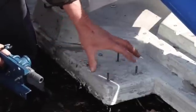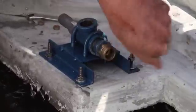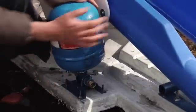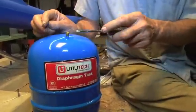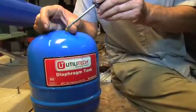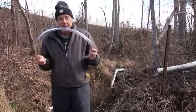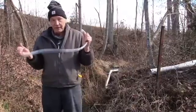You've got four empty studs left over — you could have used these for the valve tower, but since the valve tower is on the other side, we're going to use this for the pressure vessel. This is a pulse pump; every time there's rocks back and forth there's a brief high pressure pulse of water. If you want to move that water a long distance, it's a lot more efficient if you smooth out those pulses into an even flow, and for that you'll need this pressure tank. Your pressure tank comes shipped from the factory with 25 psi of air in it — that's a bit too much for this pump, so you're going to want to let a little bit of air out. Get it down to 15 psi; you'll need a tire gauge to measure that.